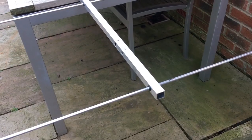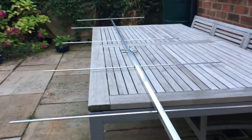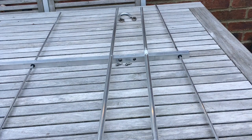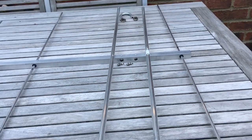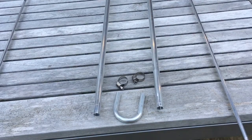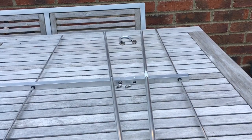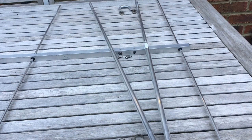So this is the Yagi made up without the dipole fitted. We've got the reflector at the back and the directors out at front, and that took less than a minute just to push those rods through. Now we have to fit the dipole. You can see the two holes in the boom — a smaller hole at the rear for the insulated element and the front hole for the radiator. There are two retaining screws. At each end there's a tuning section that slides in like a trombone slide, and you can lock it off with jubilee clips once you've found the best tune.